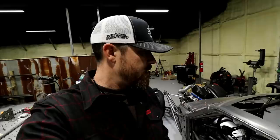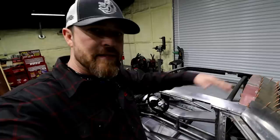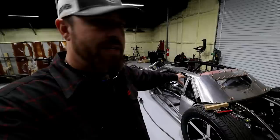The other great thing is, for instance, when I was building this, I didn't want to drag the welder around it and I didn't want to drag the pedal around. So I had it set up where it was all finger trigger, and I could crawl in and out of all these tubes no matter where I was going and weld all these joints as I went. I didn't have to worry about backing myself out because I didn't have enough torch cable. It was a huge time saver. I love that I can unravel that thing a couple of loops, get where I need to go, do some welding, and then wind it back up to clean things up.